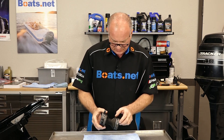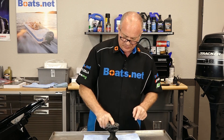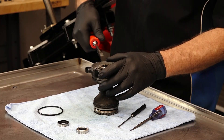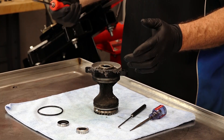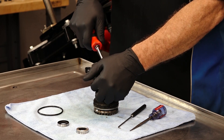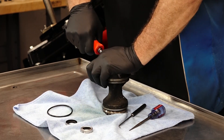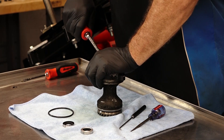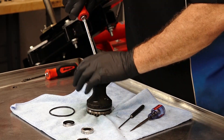All we're going to replace is the O-ring and the inner and outer seal right at the output shaft. When you're doing this, don't go into the housing and gouge it — if you do, you're going to create a potential leak. So we want to go in and pull back just a little bit and then pry in. Let's get a little bit bigger screwdriver in here. There's one — grab the other one.